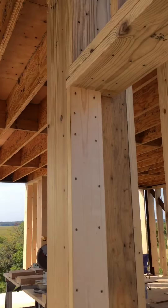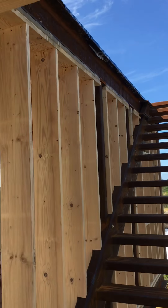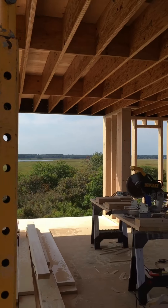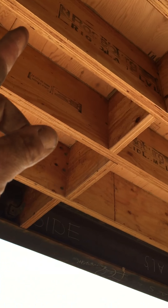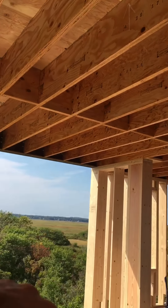This is the doorway — the glazing mullion runs down here, and then it's framed in. The siding comes in steps and so does the drywall because this is the framed opening for that door. Over here we've got the same detail because another door opening does the same thing — steps back up and makes glazing. We just gotta do the glazing that comes in here. I've got another wing wall coming in here, and those two 2x10s go right up and meet the plywood on the floor and get screwed from both sides. Then another wing wall there, and that's it.